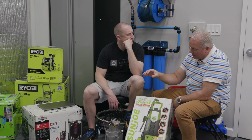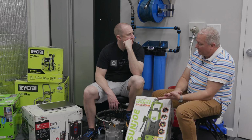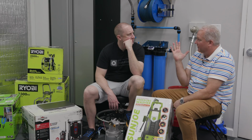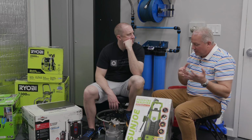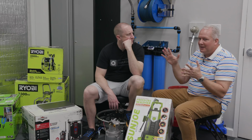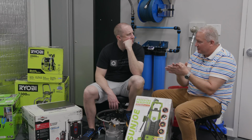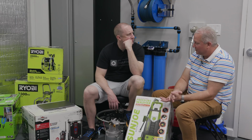So in this case, what this manufacturer is saying is this machine will activate at 2050 psi in the pump. The TSS will activate when you release the trigger handle, okay? And the reason they're saying initial discharge is that when you squeeze the trigger handle, you might get that initial spike, and then the motor comes up and now it's running at your actual rated or working pressure. But they're saying it's possible that you'll see 2,050 psi on that initial discharge.